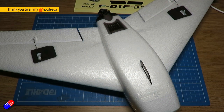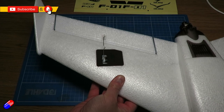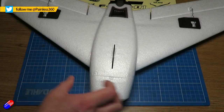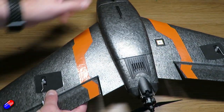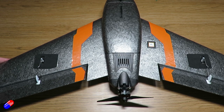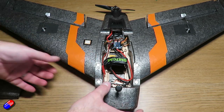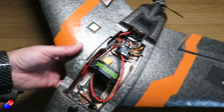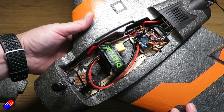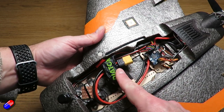Hello and welcome to the video. This is a quick look at this model here. Some of you that watch the channel regularly will be thinking that looks familiar — and it is. This is basically the same model as one I've already looked at on the channel. That original one is the Diatone Ripper R690, in gray foam, and it is one of my top three wings of all of 2021. I put the DJI air unit in the front of mine, so it's HD, using the high-capacity Tattu 2200 4S batteries and a little Matek F411 WC at the back. It goes like stink — it's like a 150 mile-an-hour wing — but you can build it in lots of different ways, and depending on how you build it depends on the flying characteristics. I built mine just to go like billio.